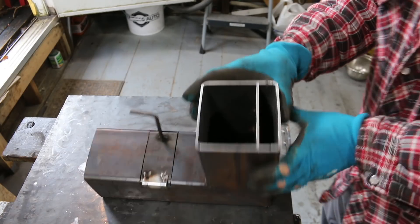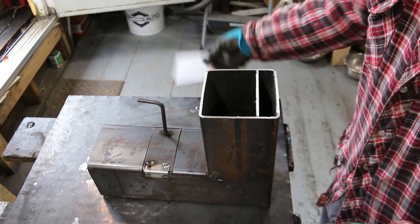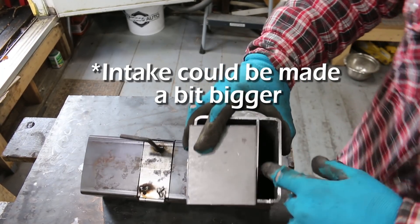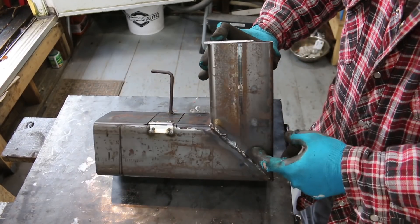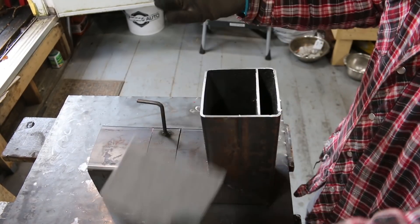After testing, I've added a door to load the fuel. I'm going to weld this plate on to close off the original opening, so the intake will be right here — one section of the pipe intakes into here, the fuel goes in here, and this is the chimney. I'm just going to weld this on.